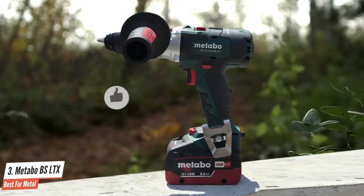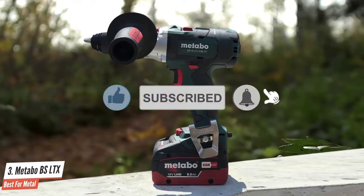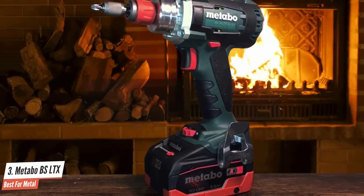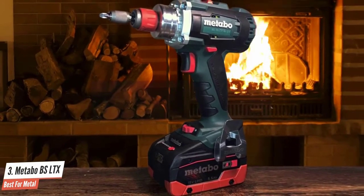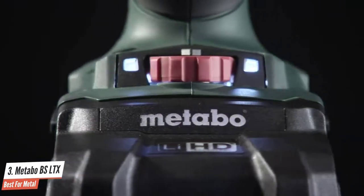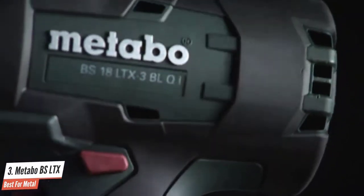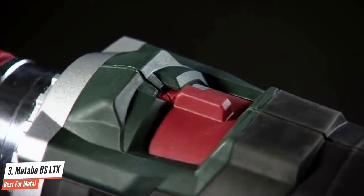Only the concrete testing results are specific to the hammer drill. The removable chuck hex spindle system — Metabo's quick change system, indicated by the 'Q' in their model number — includes swappable accessories like a right-angle quarter-inch hex, quarter-inch offset or eccentric drill, quarter-inch hex bit holder, and torque multiplier. The handle comes in multiple pieces for more than just space saving.